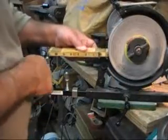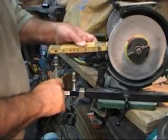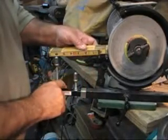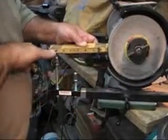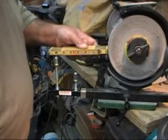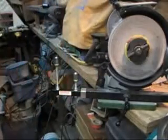Now let's set it to the right distance out. David Ellsworth says a proper distance for a good parabolic grind is 7 inches from the face of the wheel, centered, lined out to the cup. It's 7, 4, and 2 is his math, and that's available from David Ellsworth. So I'm coming out here 7 inches, and I'm going to lock it down at that point, and then I'm going to start to make the other adjustments.